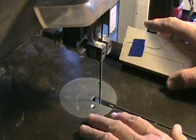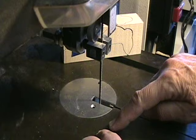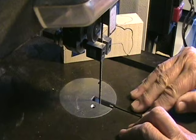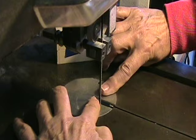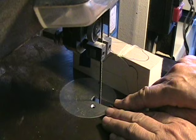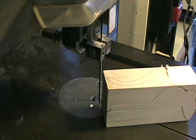Now, the dangerous part of the bandsaw is right in here — about two or three inches away from the front and partly to the sides of the bandsaw, but primarily it's right in front. I like to think of there being a little pie-shaped area, and your fingers should never go any closer to the bandsaw blade than this. The good news is you can put your fingers to the sides without danger. The main danger is right in front, especially as you come through — when you finish cutting something off, the momentum of the forward push of your fingers can bring them into the blade. That's a bad thing. Don't do that.